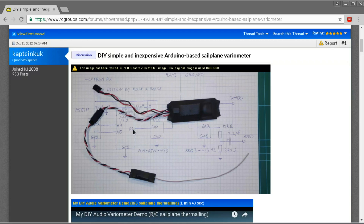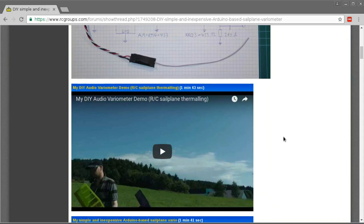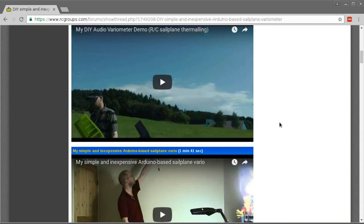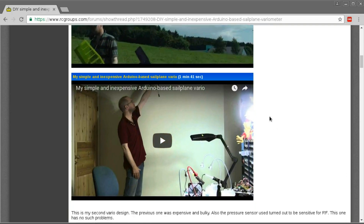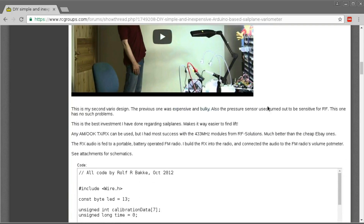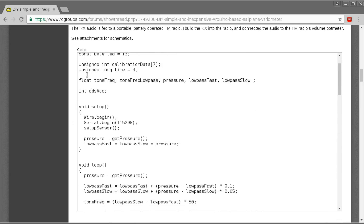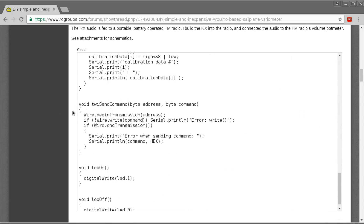There's a little circuit diagram — I managed to get away with even less than that. If you look at this thread, I'll put a link in the description. There are some demonstrations there showing you what sounds it makes. It makes the sounds I prefer as well. There are different variations, but this one makes a continuous tone when descending and an intermittent tone when ascending, and the beeps rise in pitch and frequency when ascending. And this is the code — look at it — that's the entire sketch.